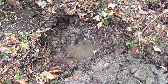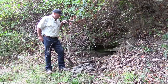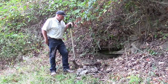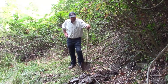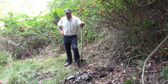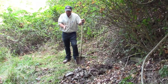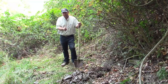What I've done here is just opened up a hole to get that water to free flow back into the old gravel bed, and it appears to be doing that at this point. There's a ton of water — of course I just opened this up, so that's why there's a bunch of water, but we'll be getting a whole lot of that free-flowing water back in our spring development. As I'm digging around here, I'm just trying to find the old 57 gravel bed that's down in here. I think it's in this line right here, but I started up higher than I anticipated.